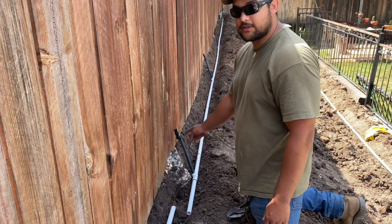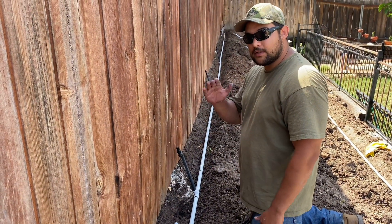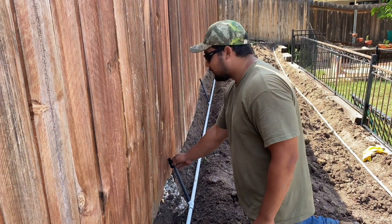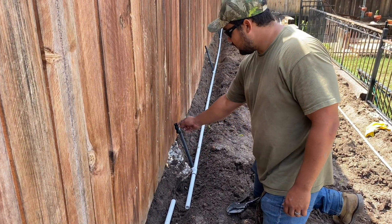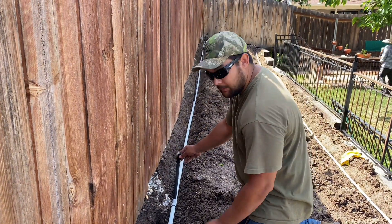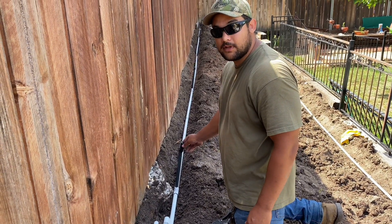Here's a little trick when you're putting these risers on the bank. Instead of angling them all individually — because when you're watering down a bank you want to angle your risers — what we do is put everything up against the fence evenly. Now that everything's aligned, we cut the pipe and rotate it like this. With the coupler we can put it where we want it, then glue it and it's done. This is a little trick for you guys.